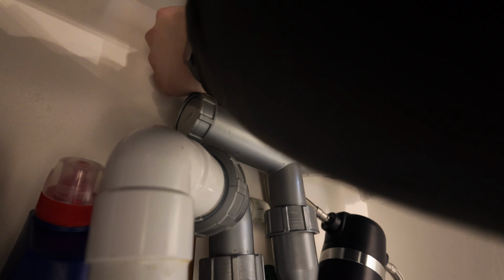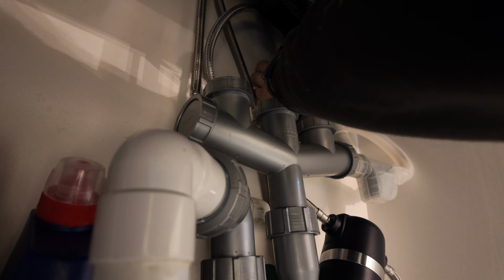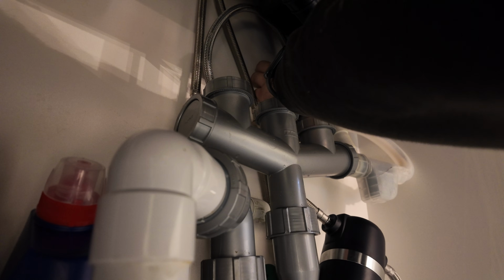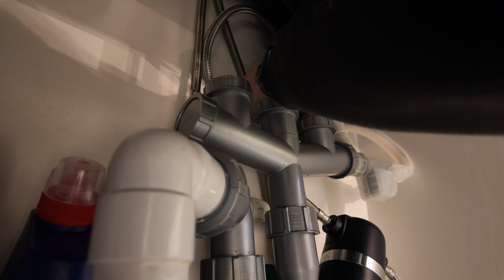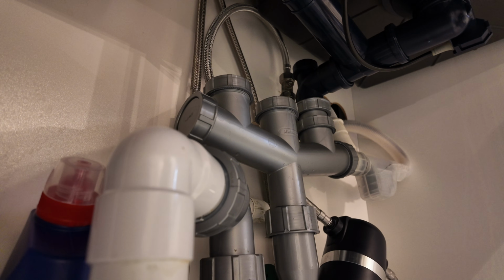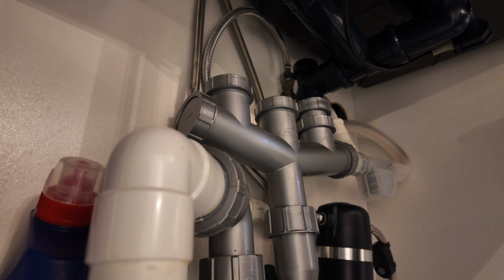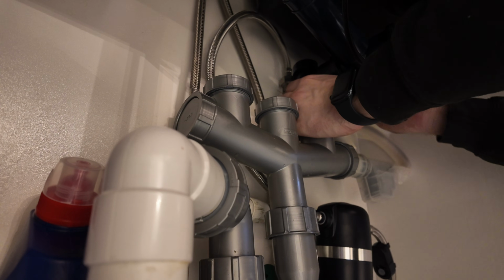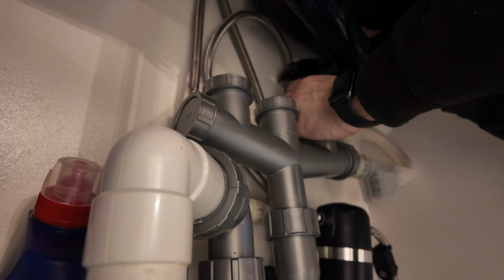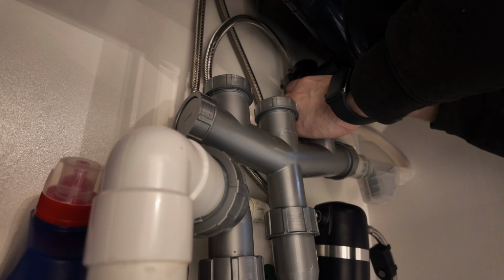So as you can see, this water filter is now falling over and creating a bit of stress on the flexi, making my job a little bit harder to connect this on. This is why I'd say to push them connections in after, but once you've pushed them in, you don't get a releasing tool to release them out, so just be cautious of that. So just going to nip this up and then hold against with my grips for the final nip up on this connection.